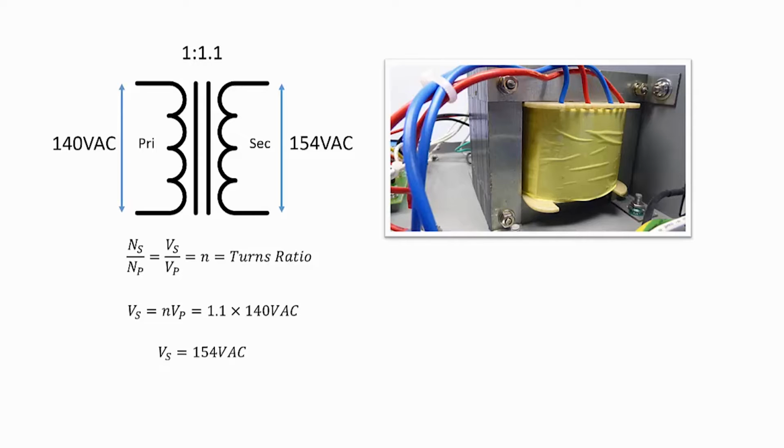Auto transformers are available in many different ratings, but a very common one for 120 volt systems is having a 140 volt output. Therefore, having the auto transformer before the isolation transformer, as I showed you in that simplified diagram earlier, allows the isolation transformer to output an even higher voltage of around, say, 150 volts. Okay, enough groundwork for now.